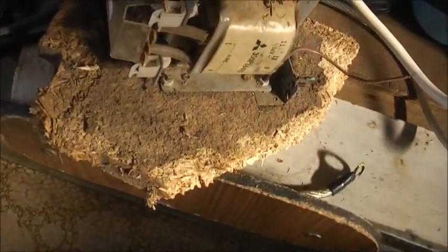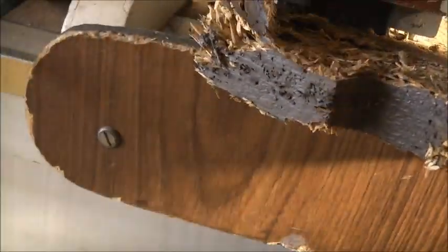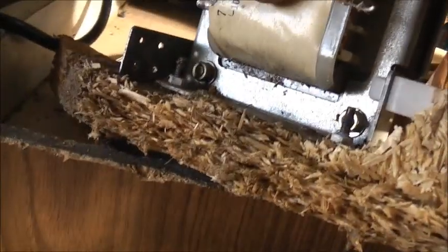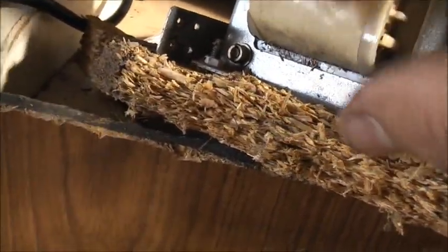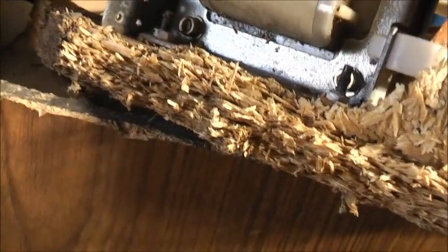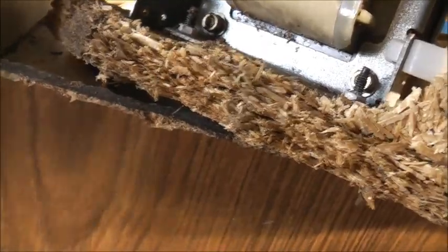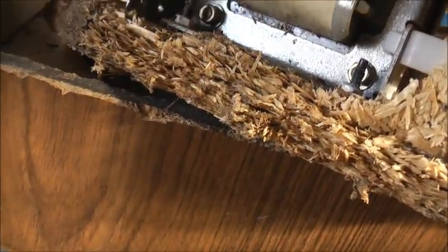I did keep the power transformer too. Slightly damaged, but the cabinet was all smashed up, so the CRT was dropped. It was dropped on its back, and unfortunately it's been out in the weather for months, but that can be fixed. I can just put some tape around that, stick that down. That's 105 volts there. So let's put that back up through there. Re-tuck that back and re-glue that. I've got a 105 volt tap.